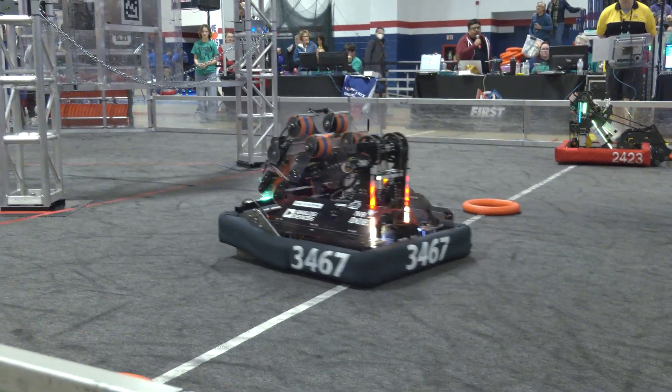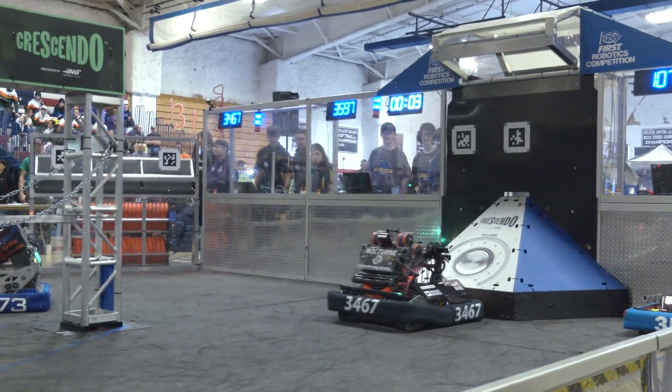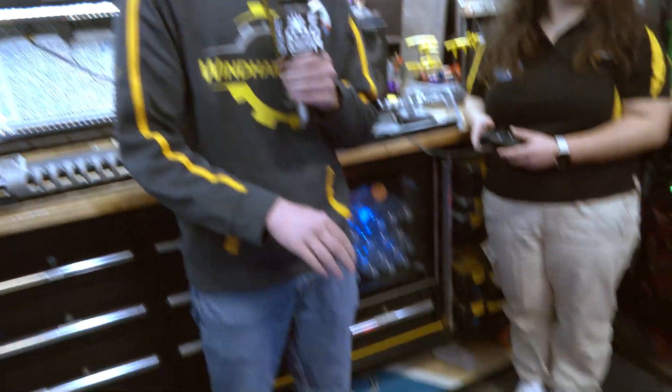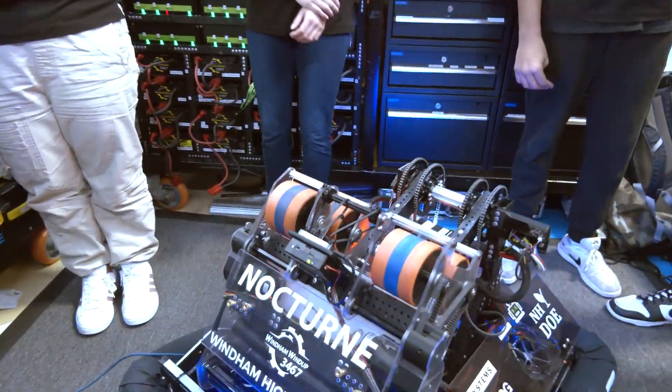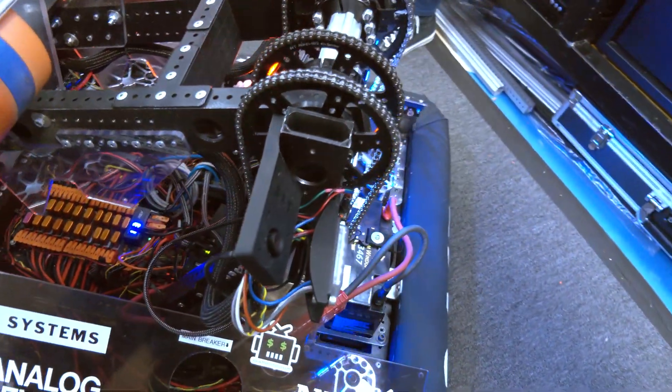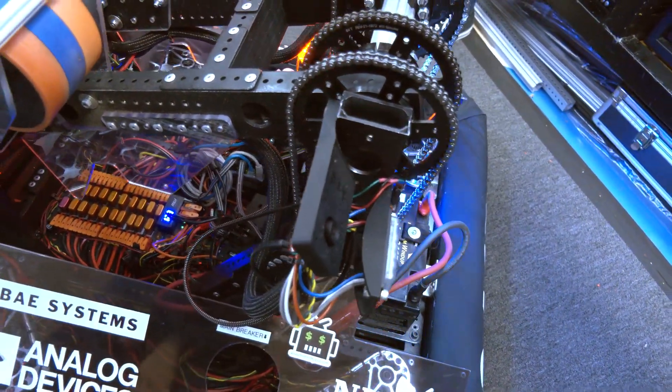Can we talk about your different types of pathing and what sensors you have on your robot? Our ArduCam cameras are connected to an OrangePi where we do all of our pose calculations — that's how we get our shoot-on-move data. Meanwhile, our Limelight helps us with note detection, so we can do things like auto note pickup, which really brings our autos to the next level and makes things much easier on our driver.